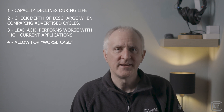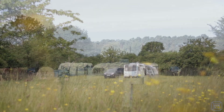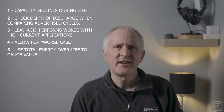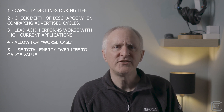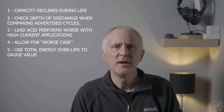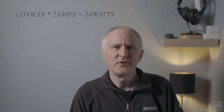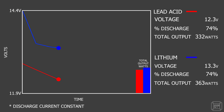It is important not to be misled by views such as 'it will last if you treat it properly.' After camping off-grid for more than a decade, there will be times when you have little or no choice but to run the battery below its recommended discharge level. When looking at value, the number of cycles should be taken into account along with the depth of discharge to give the total power the battery will actually deliver. Assuming the battery has a DOD figure, use this to determine the amp hours or watts per cycle and then multiply by the number of cycles. Lithiums get an additional bonus here: since true power is watts — related to both current and voltage — lithiums retain a consistent voltage throughout their discharge, meaning true watts per cycle is actually higher than on a lead acid where the voltage drops as capacity drops.